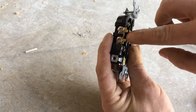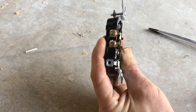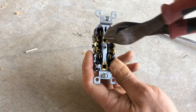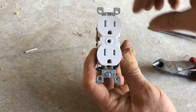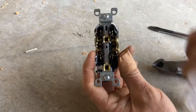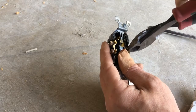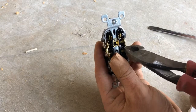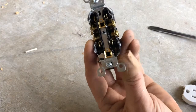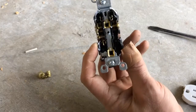This little piece of metal basically connects this terminal to this terminal, so both of your neutrals are always connected and both of your hots are connected too. There are some instances where you may want only one side of this plug on one circuit and the other on a different circuit, or you want one to be a constant hot and the other to work with a switch. The only way to do that is to take this tab and cut it — that breaks the continuity between the top terminal and the bottom terminal. In most situations you'll just leave the neutral as is because you're sharing a neutral, but this allows you to have one circuit switched and one constant hot.